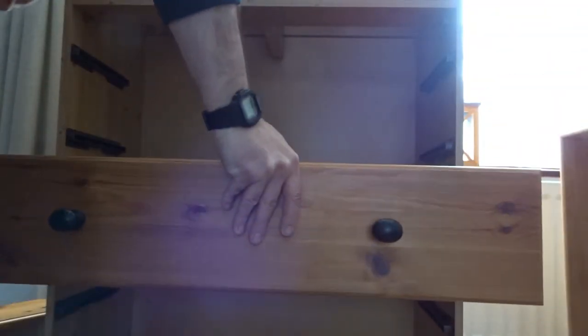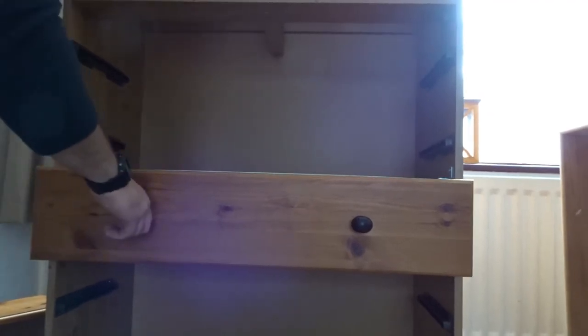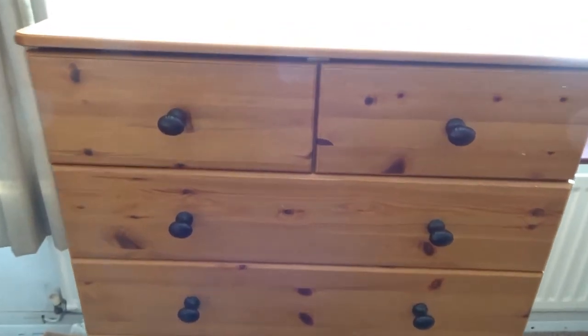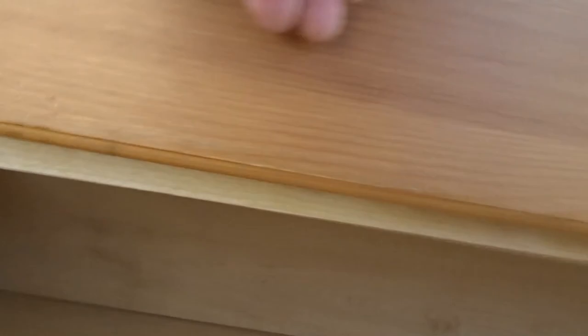So there's our bracing, and now I'm going to check the drawer again. This time round the drawer's not falling out — it's working great. We can add the other drawers on top of that and the brace just disappears. Now you can see it looks nice and straight, all the drawers are functioning as they should, and the brace I put in you can't even see. It's hidden underneath and it doesn't hinder any of the movement of the drawers, so you'd never know it was there.